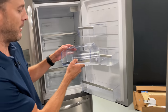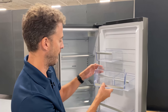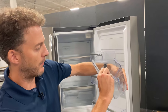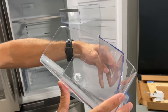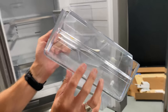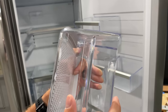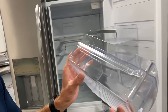There's no magnet in the Frigidaire's butter tray, and you actually have four or five parts because there's a separate IMD accented part that gives the look of stainless. The part count is much lower. Looking at the plastic itself, you can see knit lines where the plastic flowed from the gate around the hole — that's a relic of the injection molding process. With one gate it's harder to manage flow around holes, so you get a knit line. We also noticed witness lines where tools and inserts go together, where a core, cavity, or side action meets the parting line. It's very noticeable, though most people won't see it.